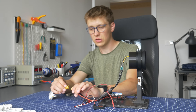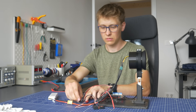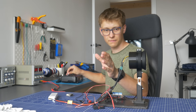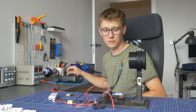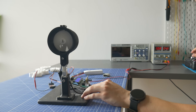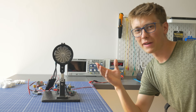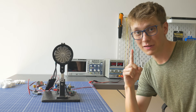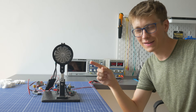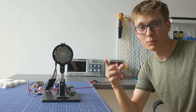It's time for the first test. I just need to connect the ESC to the battery. Everything is working fine, so let's just see if it's going to explode. It does work and it seems like it is not really going to explode, so that's a cool thing. The thrust is not really impressive, but I'm going to go outside because I feel a bit more comfortable testing it there, and we'll test all the propellers, measure the thrust and also the airflow with an anemometer. Let's go!